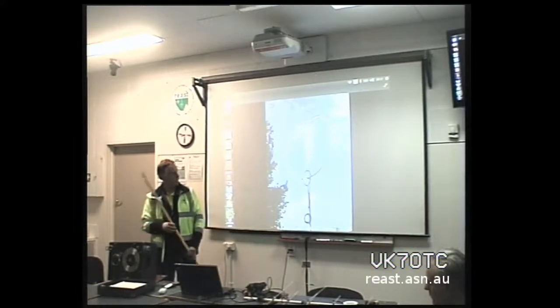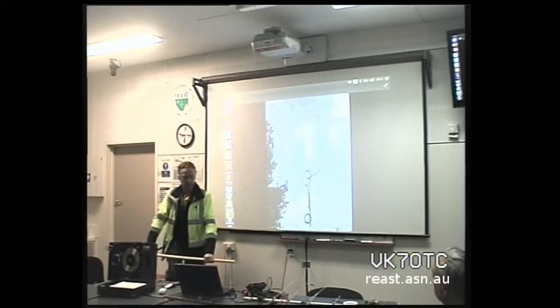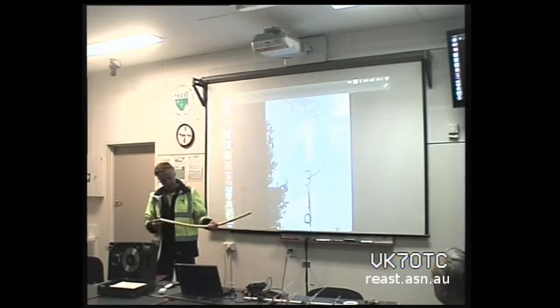That antenna is for 20 metres, so it's a 1 metre wide loop made out of plastic pipe. The good thing about this plastic pipe is that it has an aluminium layer and it's for gas. That's what it's designed for. It's kind of flexible, you can bend it a little bit. But the good thing about it is that the aluminium layer is your antenna or your radiator. And you can make an antenna out of it because 3/4 inch copper pipe fits in it very nicely.